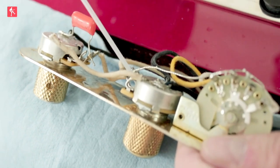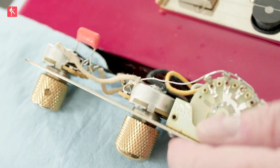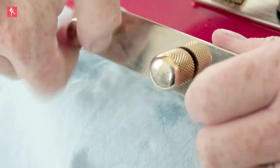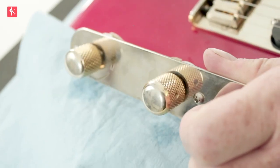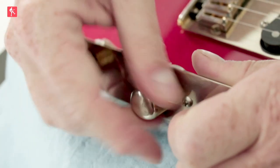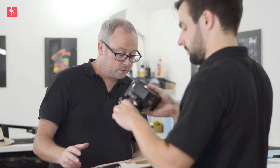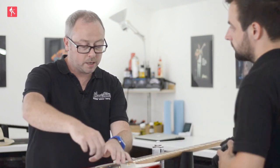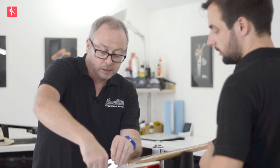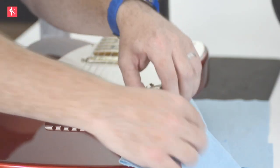There's quite a bit of excess going everywhere but it's not dangerous at all to the guitar. If you give them a turn or two, it will just allow that cleaner to get round the pot and clean them out. As we've mentioned before, if they're really stubborn and really dirty, you can do this plugged in so you can hear it — quite conveniently with the Tele because you can still have the strings on — and then you can hear them until you've actually worked all of that dirt and dust out.